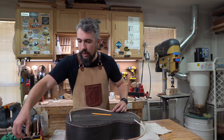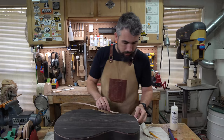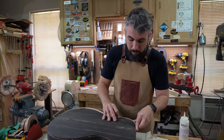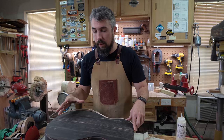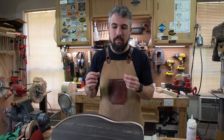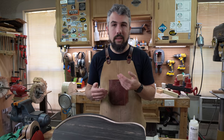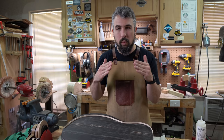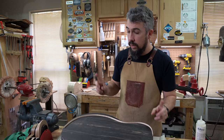We do the exact same thing to the other piece of binding. If you're doing a guitar with a standard end graft, you need to make sure both joints are very tight. Lightly tape the binding in place before marking and cutting the other end, so it sits tightly and you don't end up with any gaps. One of the very first things I look at on any guitar build is the binding — it tells you how long somebody's been doing this. The trick is to measure it about six times and cut once, and slowly work yourself up to a tight fit.